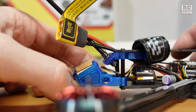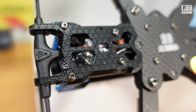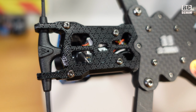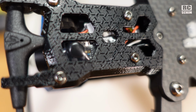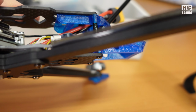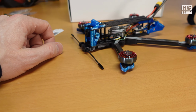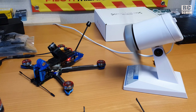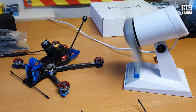You see there's still space for the Crossfire antenna. Very nice looking 3D printed part to house the Crossfire receiver down there. The bind button is right next to the antenna connector, the shiny metal object with a black dot in the middle. For the front mount, they had the receivers back there, so it's still the same part as before, but it's now in the front, which is short cables, lesser chance of interference. Nice, nice. This is my standard procedure how to upgrade the DJI Vista unit, because it can get hot. I just like how iFlight preset the OSD for me.